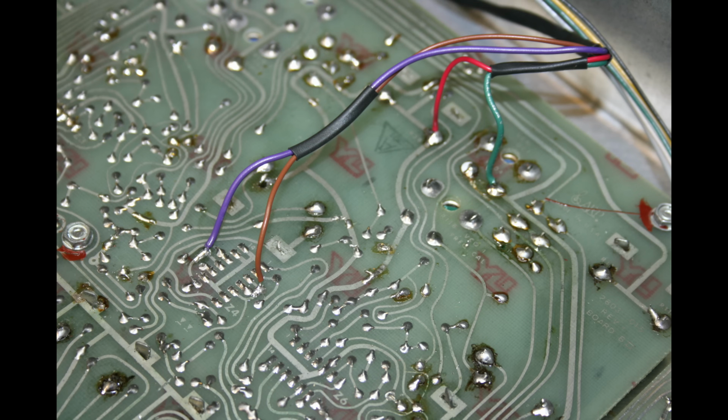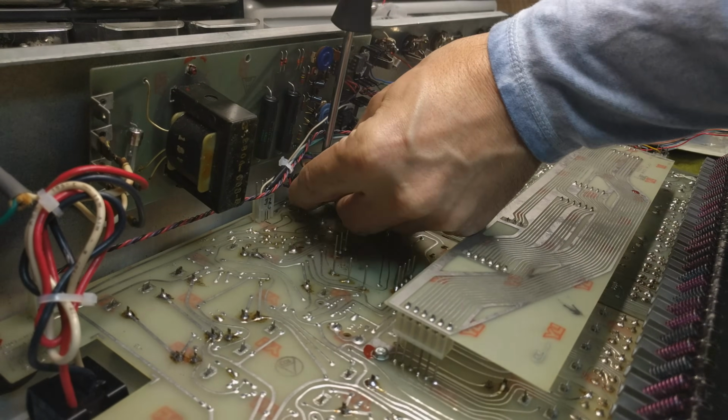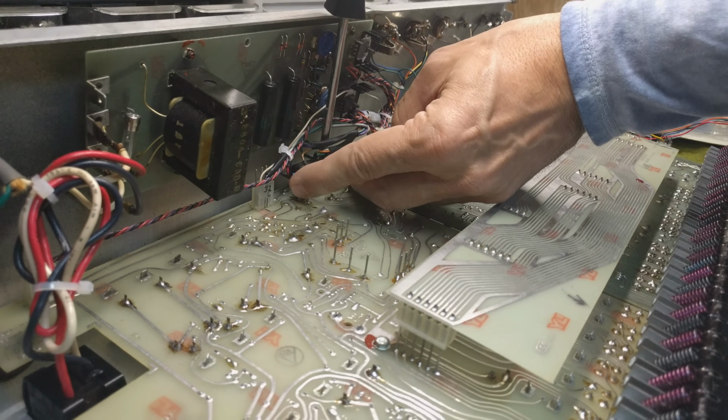to the circuit boards. We replaced one of the Odyssey circuit board screws with a standoff, and this gives us a mounting point for our new circuit board. The sub-oscillator board is pretty tiny, so all it takes is a single screw into this standoff, and the PCB is secured.